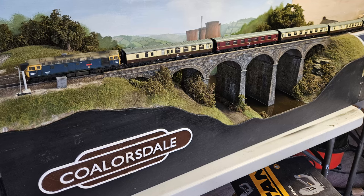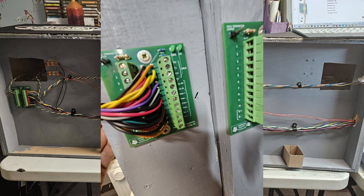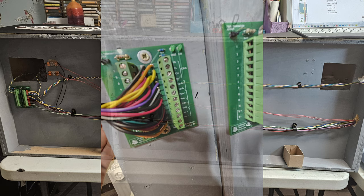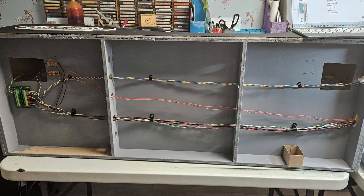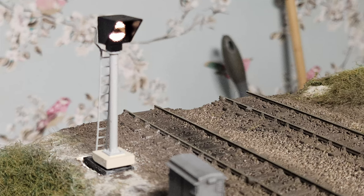I did also come along and finish the wiring. Again, most of the detail of this will be in the next video, which is going to be talking about the second baseboard that I've built. But if you just see here, I've got bus wires going across this baseboard, and then I've got joins at either end using my custom designed PCBs I had manufactured by PCBWay. All this wiring effectively just brings power to the tracks, and then on this module itself, we've also now got power to the banner repeater signal, and you can see that lit up here.